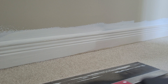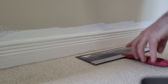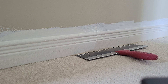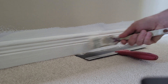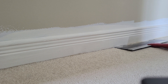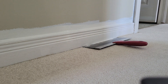I like to use these inch-and-a-half brushes, but for somebody that's not too comfortable with doing the brushwork down to the carpet, I would say get yourself one of these drywall knives — something that's so thin you can easily get it under the baseboard where it meets the carpet. Then you don't have to be so cautious and you don't have to worry about getting paint on the carpet. You can see how easy that is. It might be a little bit tight in some spots, but it works really well to paint up against the carpet.